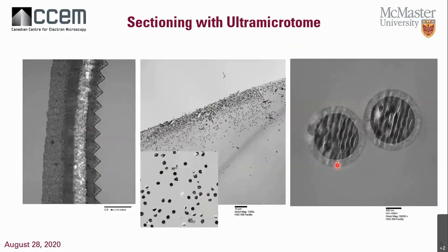To be thinly sectioned at room temperature, a sample must be inherently hard on its own, or more likely it needs to be embedded in resin. For example, membrane samples such as a membrane electrode assembly, nanowires on the edge of silicon nitride wafers, and powdered samples like silicate can all be sectioned, along with many other non-biological samples, as long as they can be successfully embedded in resin and that resin hardened.